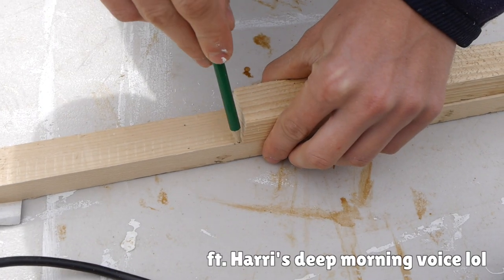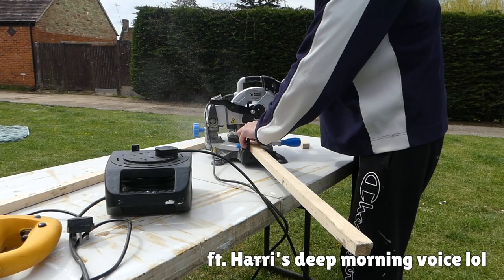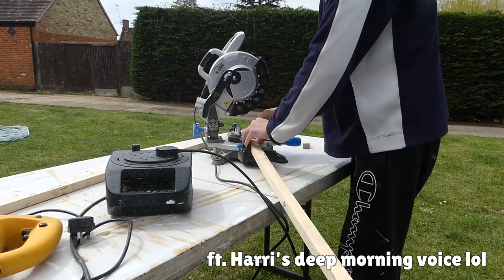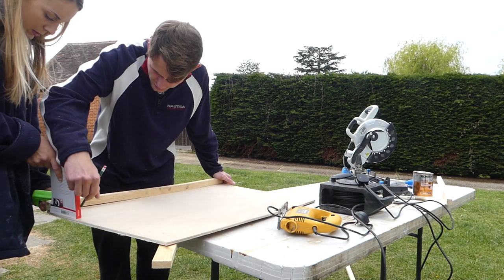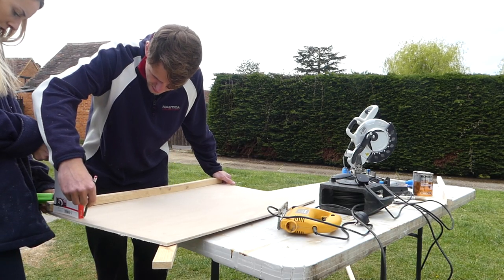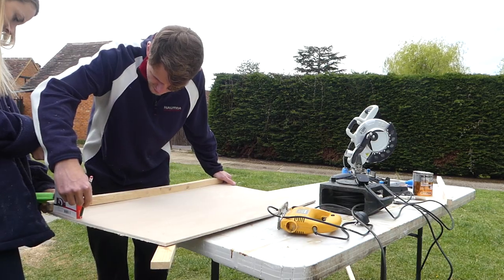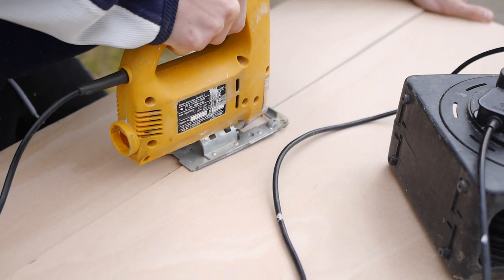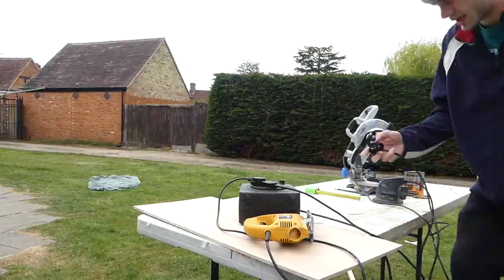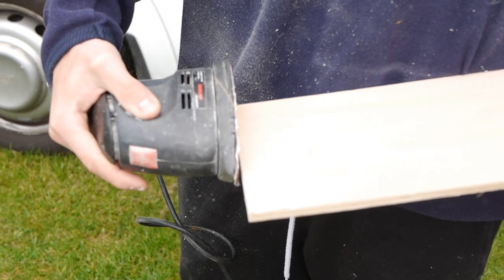For this week's video we're going to build a bookshelf, install some 240-volt plugs, and see what else happens. To start building the bookshelf we measured out two 32 by 32 timber struts to fit horizontally into the planned space, cut them using our circular saw, then marked out the nine millimeter plywood base. We made sure there was enough room for a standard-size book plus a couple of extra centimeters for a timber strut to be screwed into. We jigsawed the plywood out, sanded it, and Nikki got on wood staining both the plywood and the two timber struts.